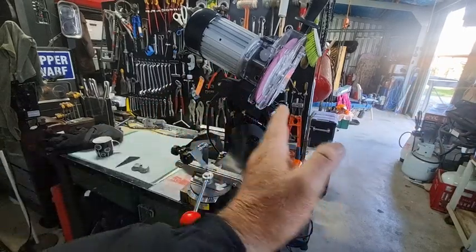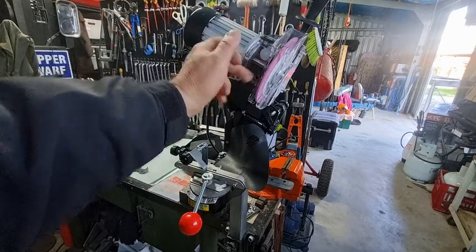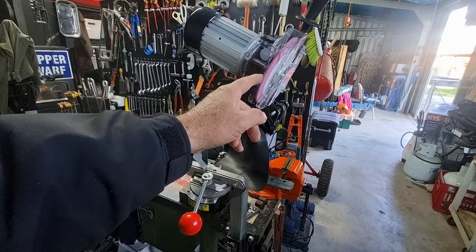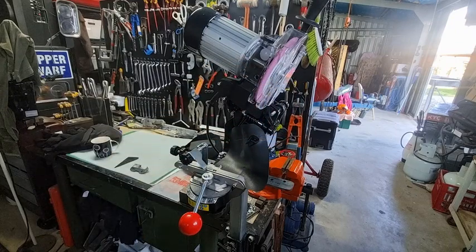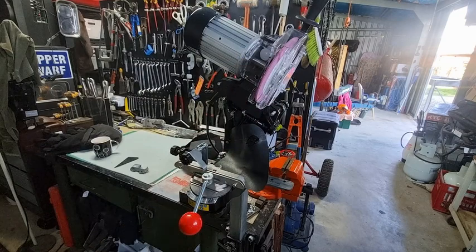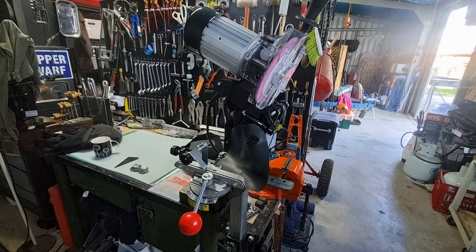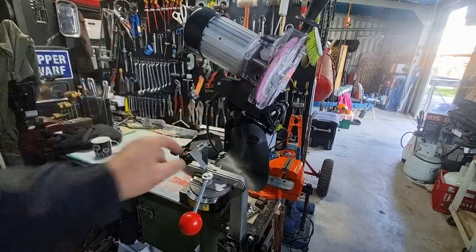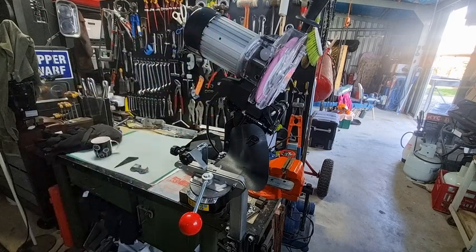If you've got any wheel run-out, your center line will be all over the place. When you put your wheel on, spin it by hand — if you have a little bit of wheel run-out, which most likely you will (I haven't seen one of these grinders without some wheel run-out), loosen the bolt and put the wheel in a different position. You may have to do that five or six times. If that fails, I'll put a thin cardboard gasket behind the stone — the cardboard compresses whereas the stone doesn't. Move the wheel around until it's truly running true, then eliminate as much wheel run-out as possible before dressing.